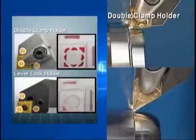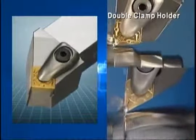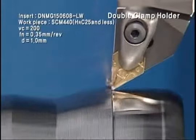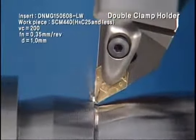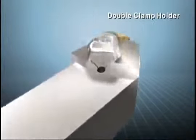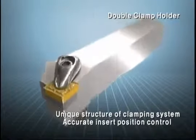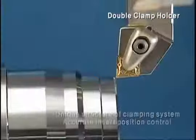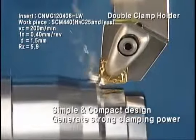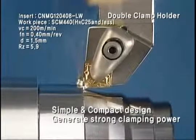The D-Type Holder shows perfect contact with the insert at the bottom face as well as the periphery side. It displays superior performance in high-intermittence conditions compared to products of other companies. The independent structure of the D-Type Clamp materializes accurate position control in assembling with the holder, and also materializes a compact shape which does not interfere with chip discharge, with an optimized design that delivers strong clamping ability.